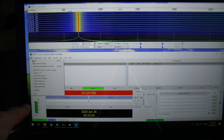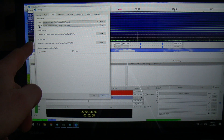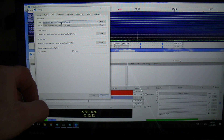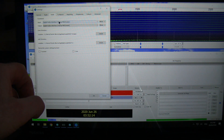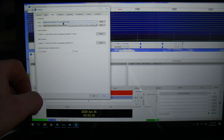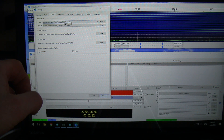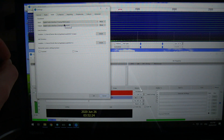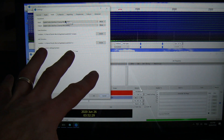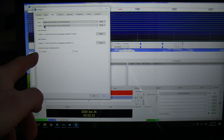If I just go down here to File, Settings, and then Audio, you can see there that the sound card for the input and the output is this digital audio interface to the Teensy. So the Teensy cable has been set up to be Serial/MIDI/Audio — you had to have MIDI. And as soon as that was enabled it was presented to the operating system as a valid sound card, and as you can see it's working perfectly fine.